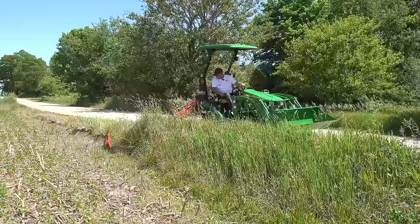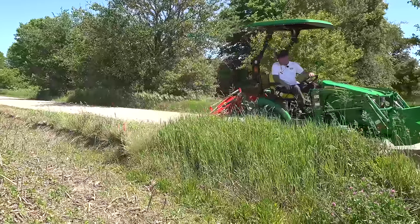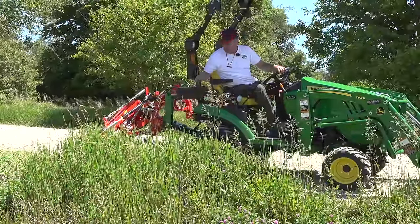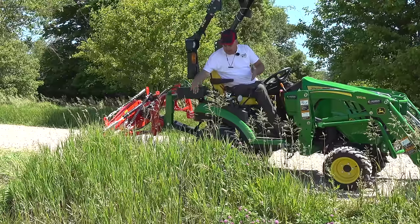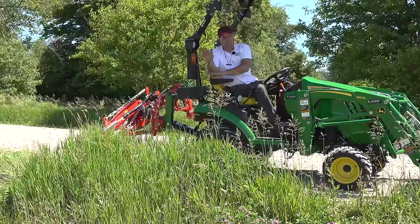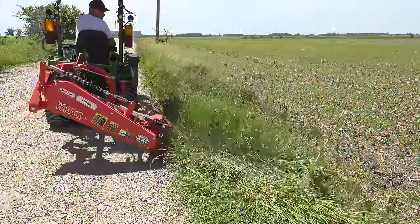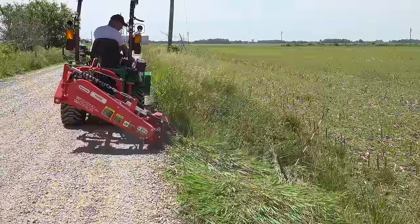This is a pretty good angle — probably 25 degrees. I'm guessing it's not near the extreme the mower can do. I want to describe some of the choices I have in allowing that bar to go down. I have a challenge at the top: there are rocks right here in the road, so I don't want the mower down in the rocks at this end. Also the actual curve of the ditch bank is a little further out than the beginning of the mower. So if I put this mower all the way down, not only will I hit the rocks, I'll hit the edge of the hill and the boom will stick straight out. By raising the three-point hitch up, I can raise up this side of the mower and allow the outside of the boom to go down. This is one of the reasons I like the hydraulic lift option — it gives me more control than the manual lift.